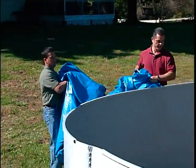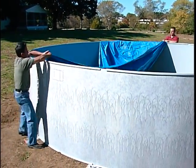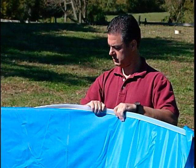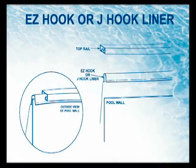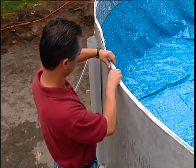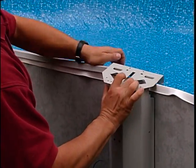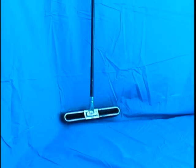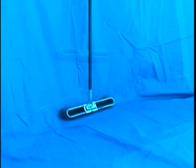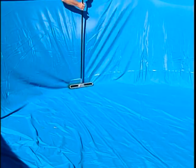Place the liner into the pool keeping hold of the two ends. Pull the ends of the liner to the opposite ends of the pool in the center. If you have a standard overhang liner, overlap the liner over the wall and temporarily secure it using the plastic edging. If you have an easy hook or J-hook liner, place the hook part of the liner onto the top of the wall around the entire pool. Temporarily place a few of the top rails over the liner and wall for support. Use a soft broom to stretch out the bottom and make sure the liner seam is resting totally on the earth mound and not suspended in the air. Continue all around the pool until the liner has fully opened up and is resting on the bottom.